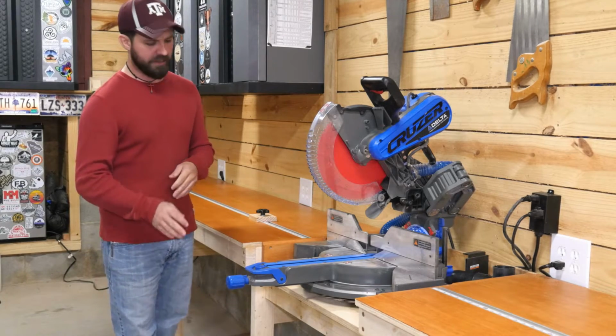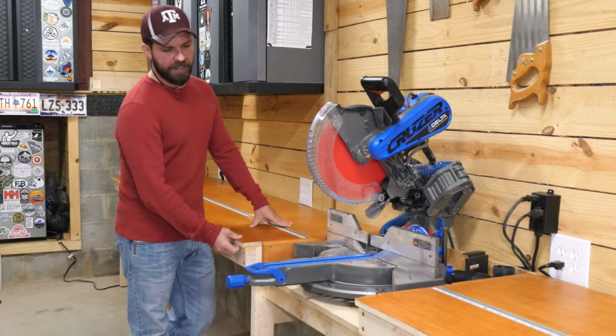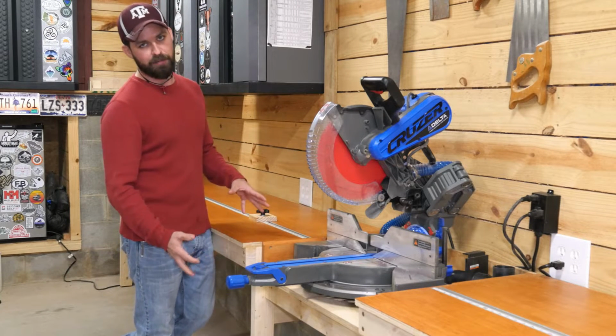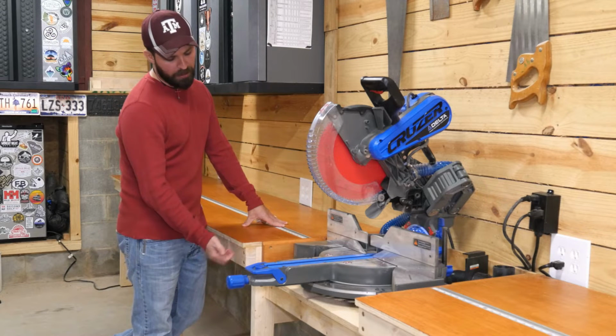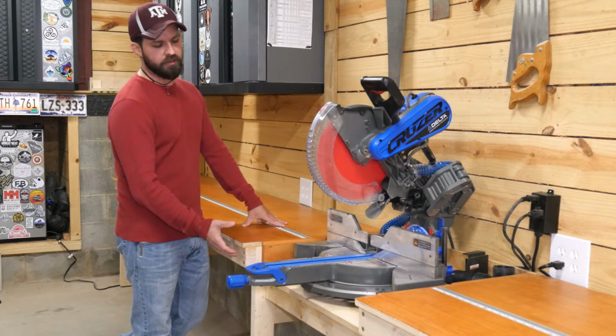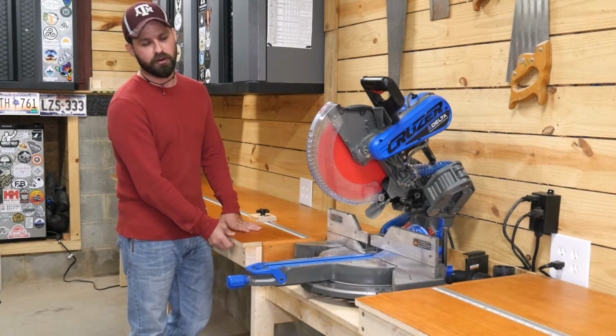The only thing I would have done differently is change the width of the frame. I had originally planned on leaving a 2-inch overhang on the tabletop, but due to a modification I made in the middle of the build, I wound up only leaving a 1/2-inch overhang. That's not a big issue other than the fact that I wanted to leave the 2-inch overhang in case I wanted to clamp something to the surface.